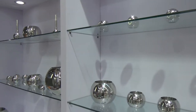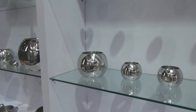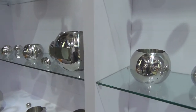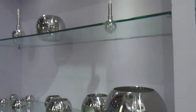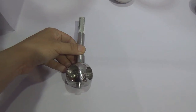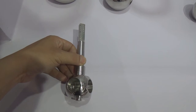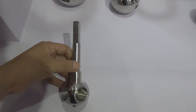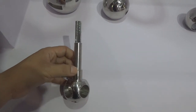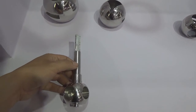In China, not all manufacturers are going to produce all the valve components by themselves. Some manufacturers are going to produce valve components only. Just like this manufacturer - they just produce the ball for the ball valve. Let's look at some special balls from this manufacturer. First let's look at this kind of three-way ball valve ball - it is an L-type ball valve ball. The valve stem is already connected with the ball - the manufacturer already connected the stem with the ball, so the manufacturer doesn't need to produce a separate stem for the ball valve.